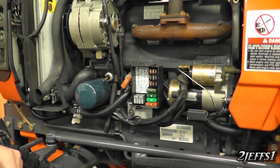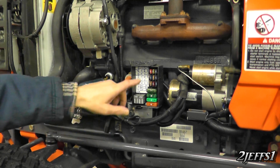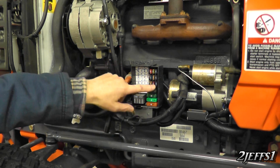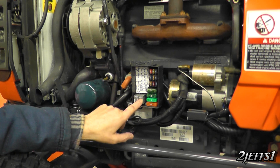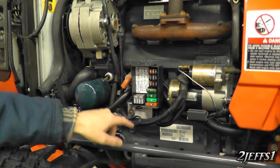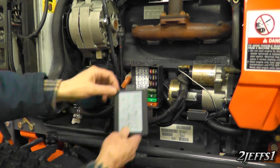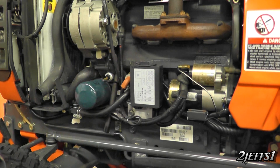This is a box I made for the Kubota here where I put a lot of extra accessories on. I went with a 78-amp alternator and then put this fuse box in. I've got 12 circuits on this here plus your main feeds. Also, to take the load off the headlight switch, I got tail and head separate on there. The aluminum bracket, two-sided tape, and one little screw underneath help hold it on, and a cover keeps it protected.